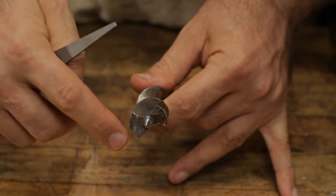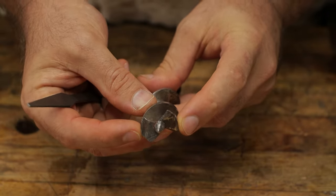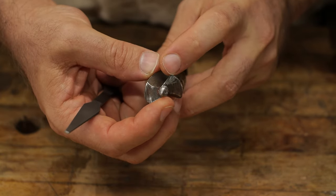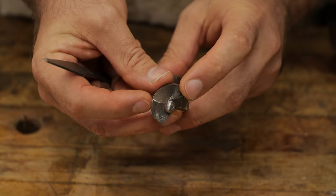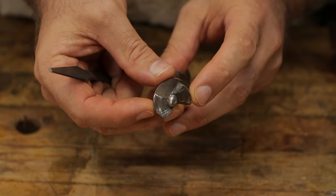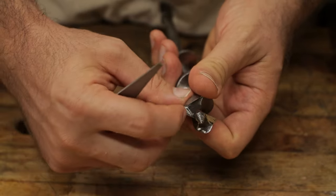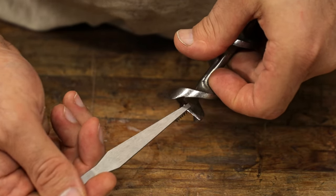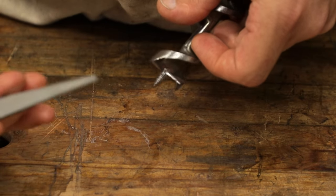When it comes to sharpening the auger bit, we have these two wings here and these wings score the wood as the auger bit pushes in before the main cutter teeth engage. So essentially you have two knives on the side — you want them to be nice and sharp. On the inside is essentially a chisel: we've got a flat bit on the top and a little bevel on the back edge, and that's what comes in and removes the material when the auger bit is pulling in.